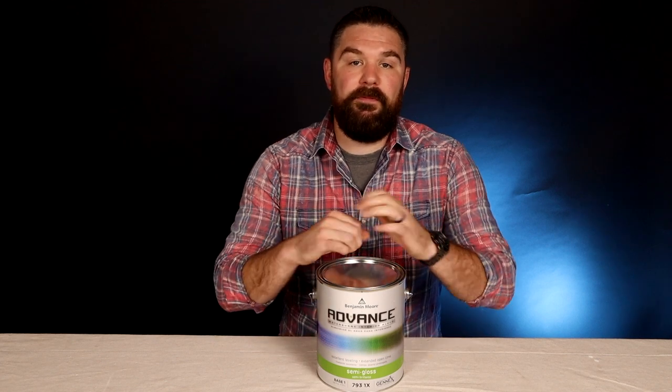Overall, I like this product. It's still not my go-to trim paint, but we've been using it more and more for specialty applications. I think it's great for high-use surfaces like bay window sills, mantles, cabinets, and furniture, as long as you respect the open time and allow the paint to cure. If you found this video useful, consider hitting that like and subscribe button. Keep your eyes out for the next video, which is going to be a comparison between this product and the Emerald Urethane from Sherwin-Williams. Until then, take it easy, work smart, and have a good one.